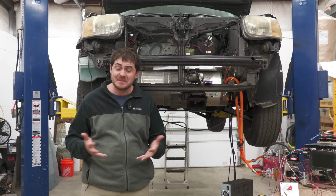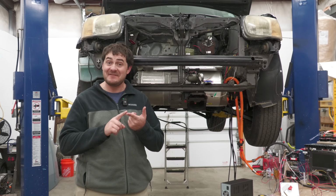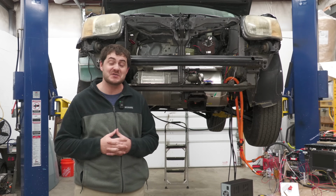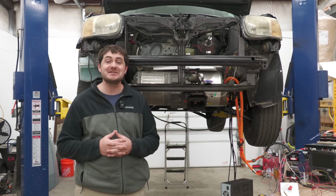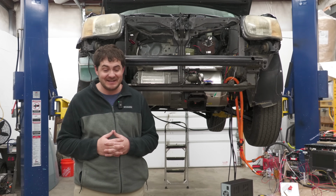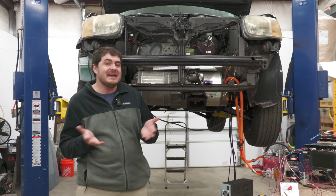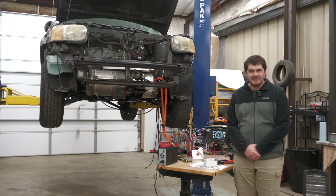In fact, my last correspondence with that guy was him saying, oh, of course your VCU doesn't work. You've got to have the BMS and current sensor wired up. Otherwise, it won't close contactors or make the motor spin. But the one time I did get it to close the contactors and make the motor spin, the BMS and current sensor were still in their boxes. And I told him that and also added, is this something that's required by new firmware maybe? And he didn't respond. So I did what any reasonable person would do, and I gave up on that VCU.